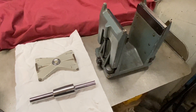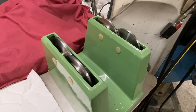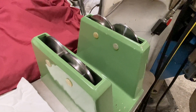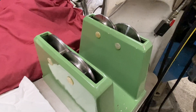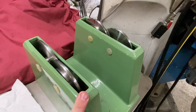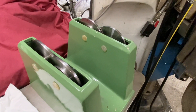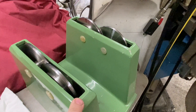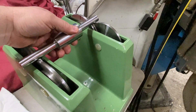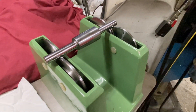The system I use now is this four wheel balancer. It's typically used for balancing grinding wheels. You can get very precision versions from companies like Jones and Shipman, which are very expensive but very nice to use and very accurate. This is a lesser model — the sort of thing prevalent in motorcycle shops for balancing wheels. I bought this second hand, had it about a year, and it's a fantastic piece of kit. You don't need to level this — you just put it on the bench, put your flywheel on the mandrel, place that on there gently, and it will find its own heavy spot. Let's get on to balancing and I'll explain what's going on.